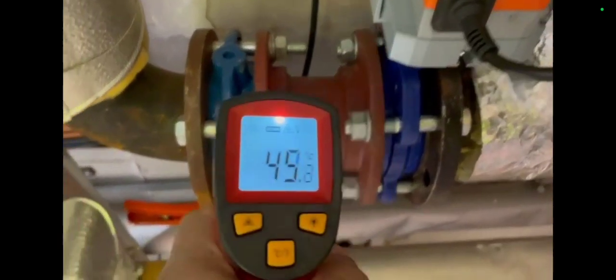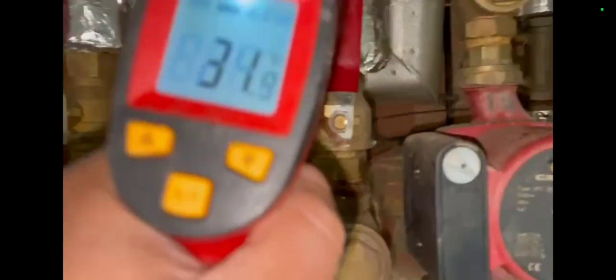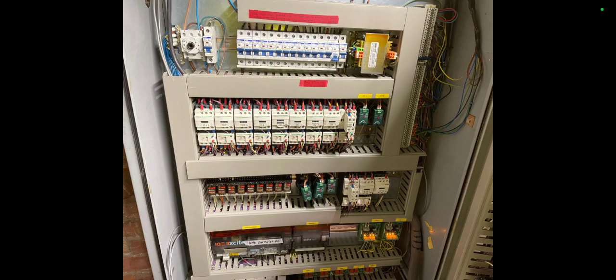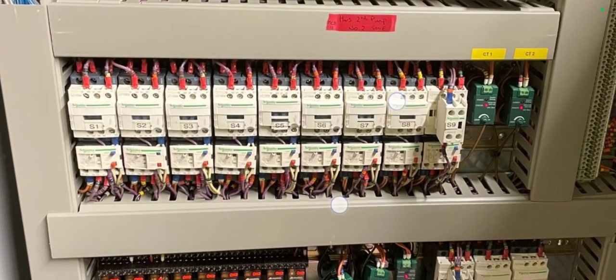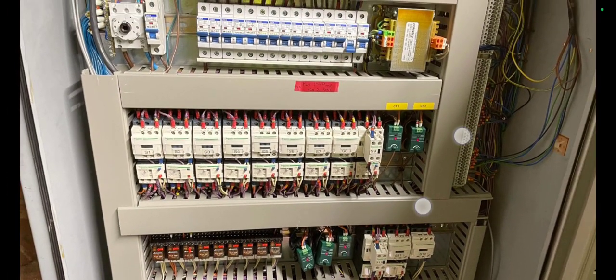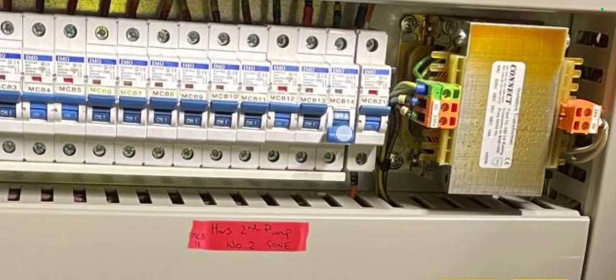I had 30°C on the ceiling heaters, then I'm checking the pipework going to that particular area so you can see the heat loss. I want to make sure all the zones are getting hot. I've got some sort of fan coil unit with fans running and pipes running through — the heat is coming through slowly. I got the temperature up in that part of the building where the fan coil unit was to about 11°C — it was zero at the time, and a lot of the rooms are close to freezing, but people noticed the difference. Inside this panel I had to hit the reset on the overcurrent and force the pump to open — it had also tripped the breaker.